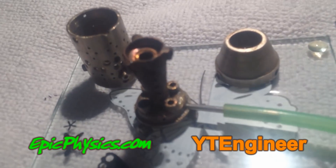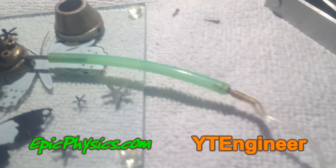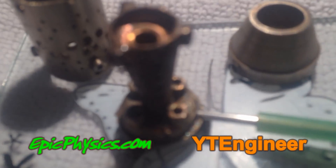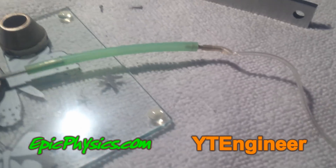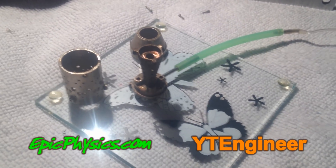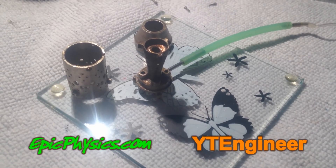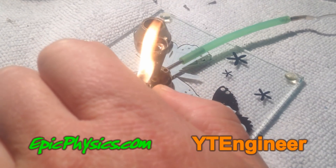I have also done some tests on the combustion chamber. I seem to have forgotten to add holes to the front of the combustion chamber, but I will rectify that in the future. So far the combustion chamber seems to be working very well. Believe it or not, this is actually a 3D printed stainless steel part, and as it is 3D printed you can be a little bit more creative with the design.